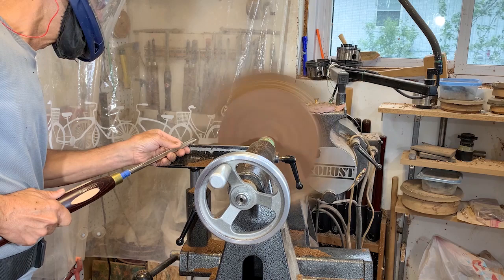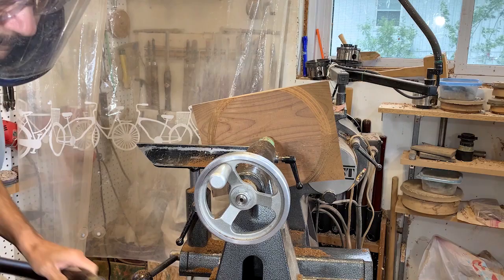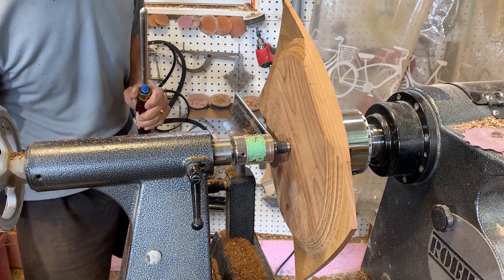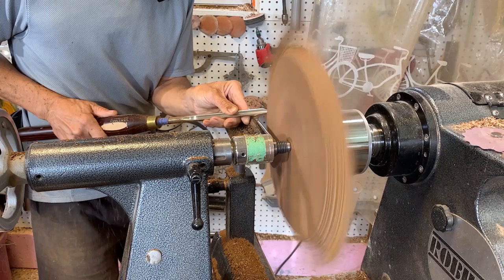This is now a final cut in that first two or three inches, and when I have it the way I like it I won't go back to that surface again. The wall thickness wasn't totally consistent — it's a little bit thicker as I go in — so I'm going to take another cut to go in a little deeper and really try to get that wall thickness even all the way along. Your eye will really notice it if it's not consistent.